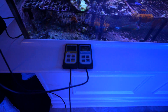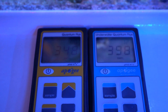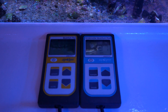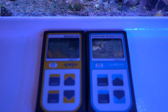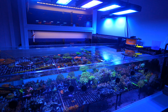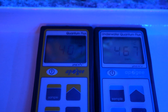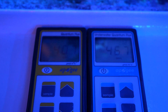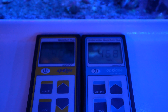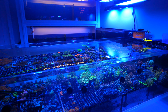Under 14K, approaching 400 PAR — this is where discrepancies start appearing, more than the 10 percent we saw at 10K. Moving to 18K, we're getting about 400 on the old meter and 470 on the new, roughly the same percentage difference, starting to drift a little more.